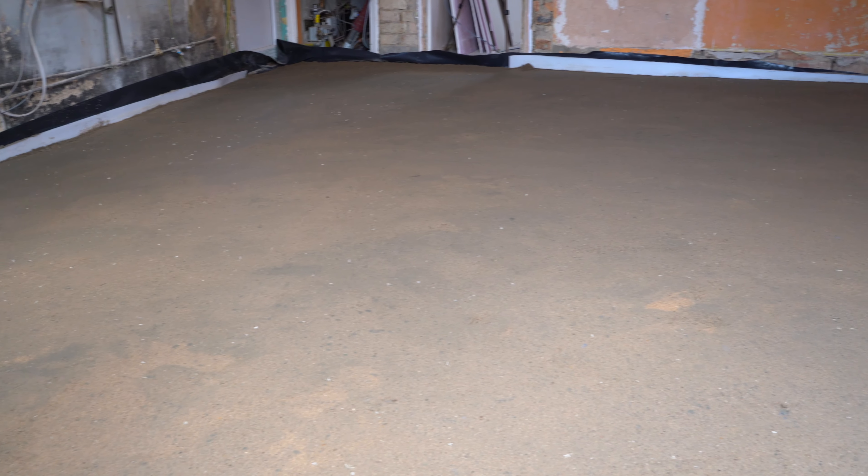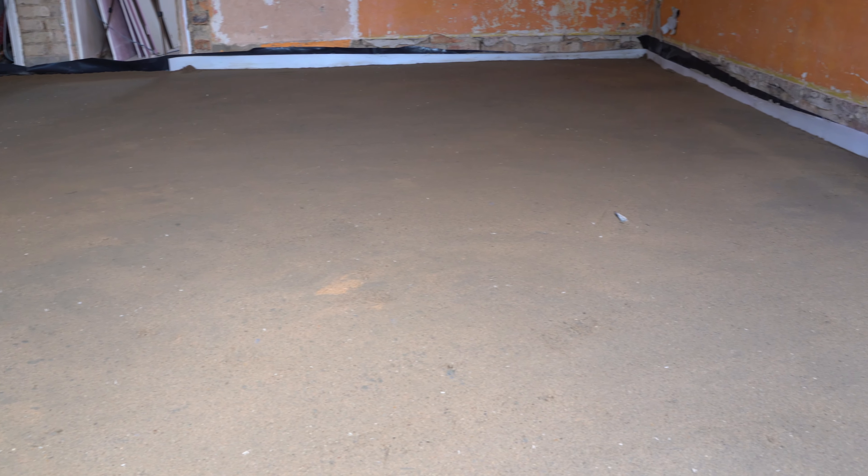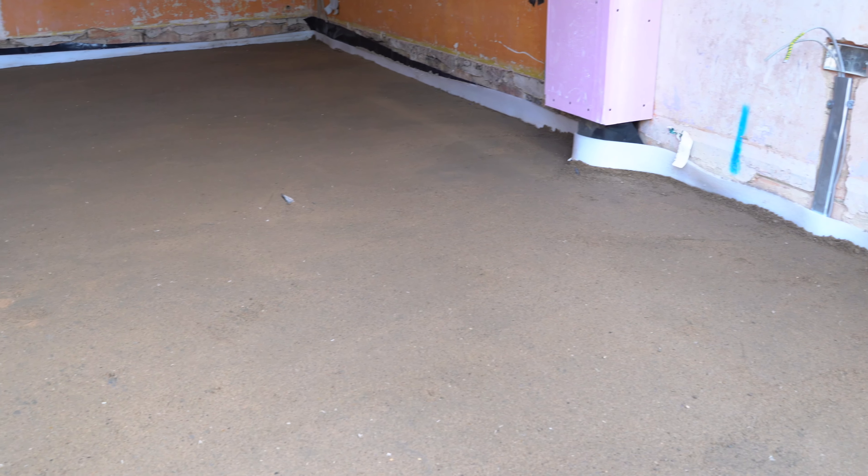As you can see, we've now done the floor screeding — been a bit of a warm one. It doesn't look like an art piece, I'll say that, because when you're checking your level and pulling your trowel off you do get a little indentation until it's solidified. But this is the first phase of building the floor back up.